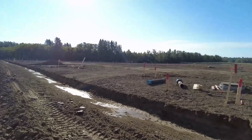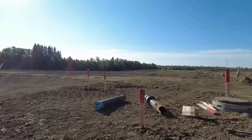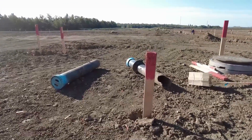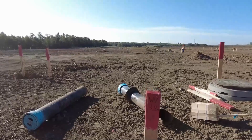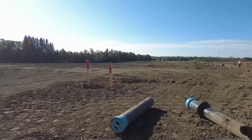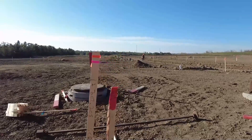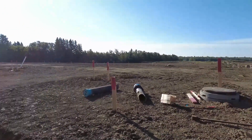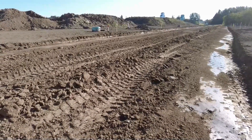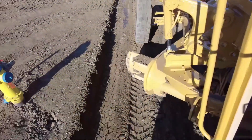As we're pre-grading, we've got a water valve. You have to be extremely careful with this when pre-grading, because if you hit that water valve hard enough, you're going to break it. If you break it, somebody's digging down 10 feet to fix it. It's an expensive repair. So when you see a water valve out there, you need to know how deep it is so you can stay away from those valves.